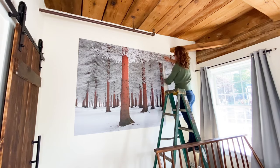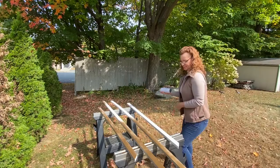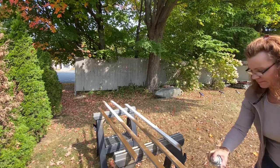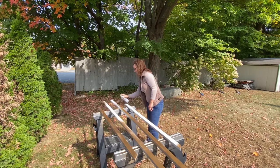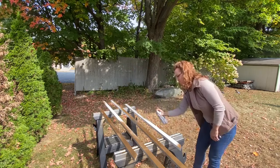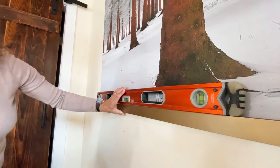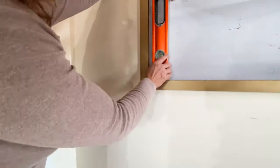Continue these steps until all the panels are up on the wall. I added a few coats of gold spray paint to the frame I made. I made this frame with PVC — select pine would have been much better since the PVC does bend on a large scale. You can cut a 45-degree angle at each end or just butt the ends up together for your frame. Attach the frame to the wall with a brad nailer, and use your level to line up and check that your frame is straight and all the angles are square.